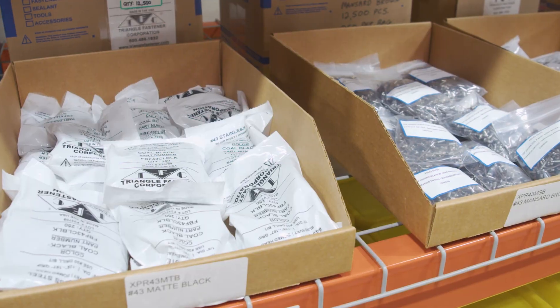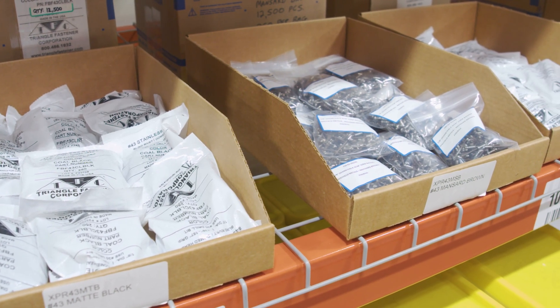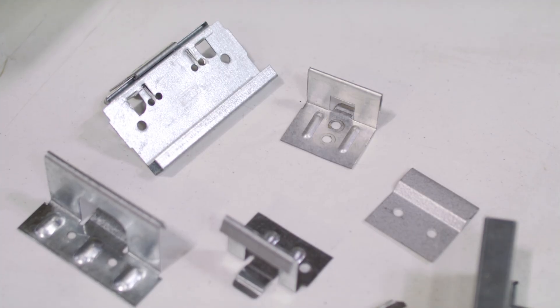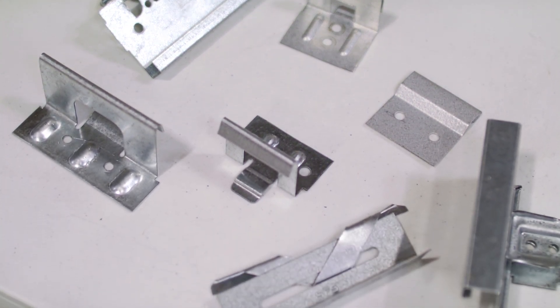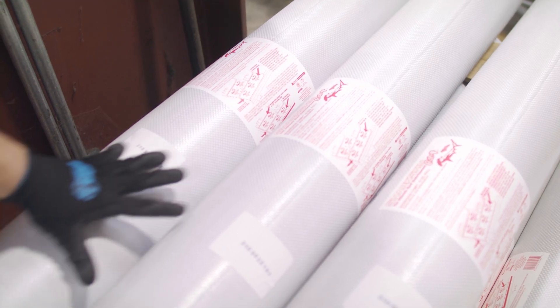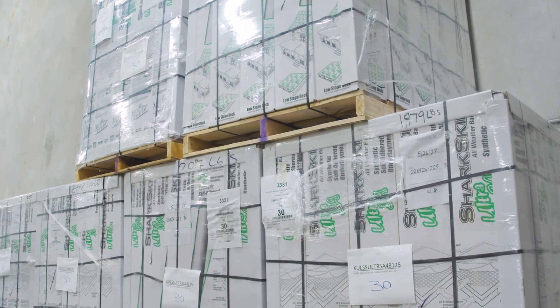You tell a contractor these are the fasteners we need, they go out and think they get the right ones, then on the job site they aren't right and you've got 20 squares installed with screws that don't match the engineering — now you have 20 squares of problems. All accessories that can be provided by Sheffield should be provided by Sheffield. If there's a mistake, it's on the supplier, not the contractor. The real question gets into play with products that aren't supplied by Sheffield or when a substitution is needed because of a spec requirement — usually underlayments and rooftop curbs are the two big ones.